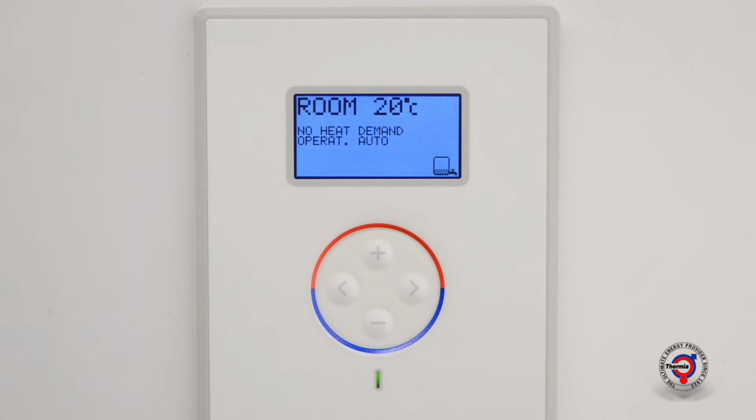The indoor temperature is adjusted by changing the heat pump's heat curve. The heat curve calculates the supply temperature depending on the outdoor temperature. A properly tuned heat curve minimizes maintenance and provides an energy-efficient operation.